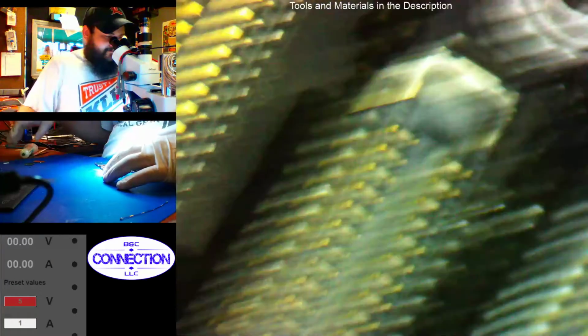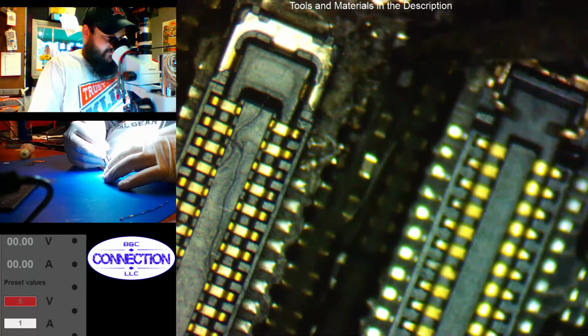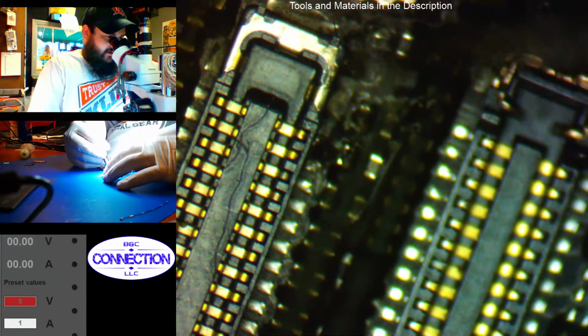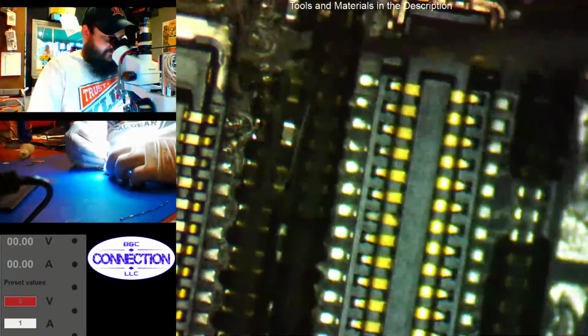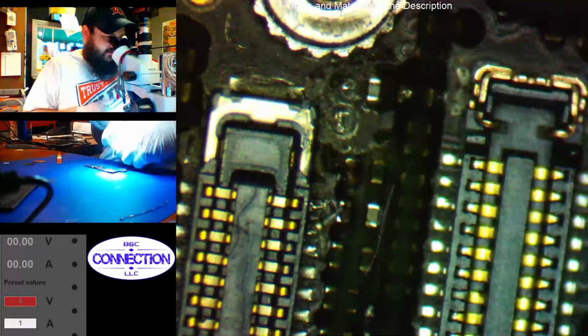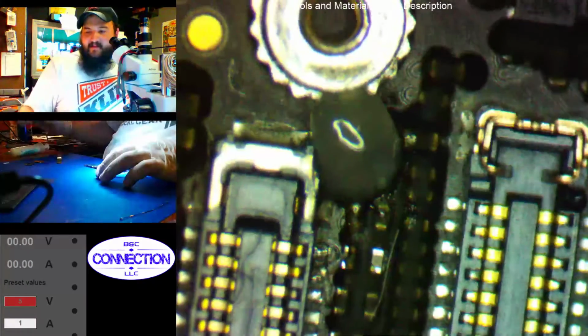Alright. Let's clear out a little bit of our underfill and see what we can salvage here. The other day I had to run a jumper on one here anyway. This pad was gone on a different phone that had water damage also, so it might be there actually. Let's add a little, see if I can push a little more flux out of this. Yeah, it's like a workout every time I'm trying to get flux out of the tube now. Oh yeah, the pad's there.